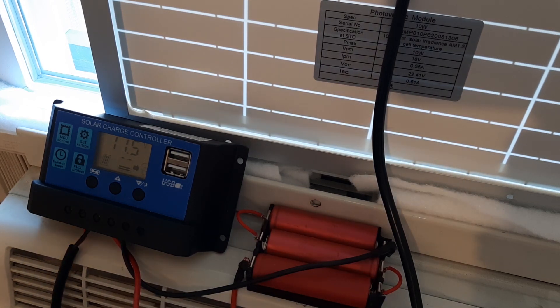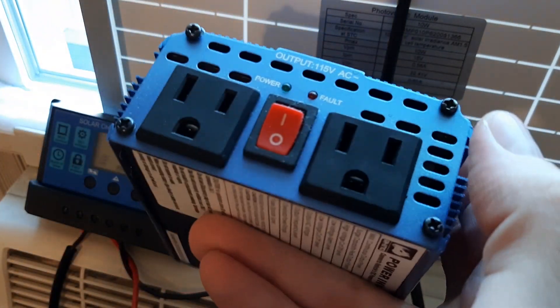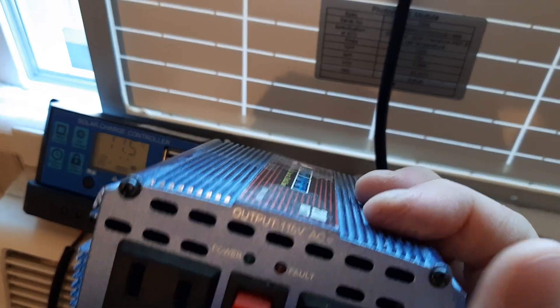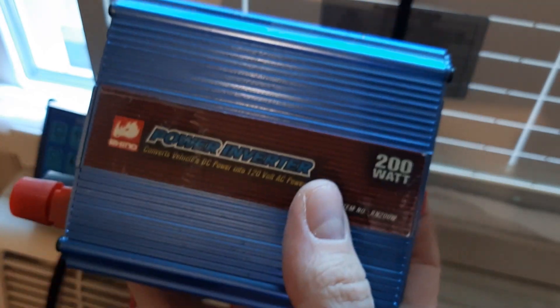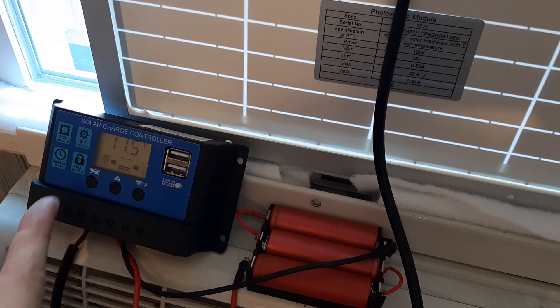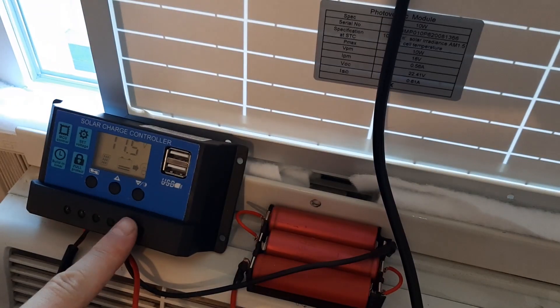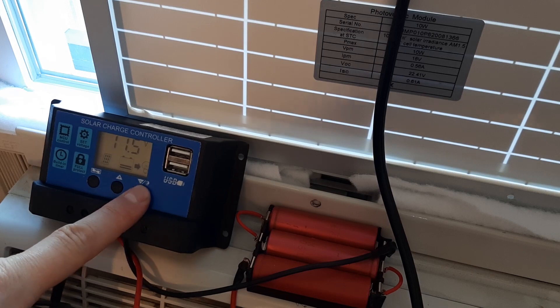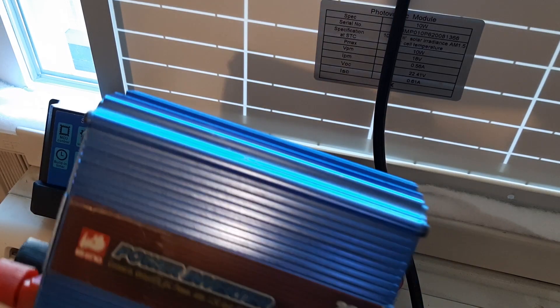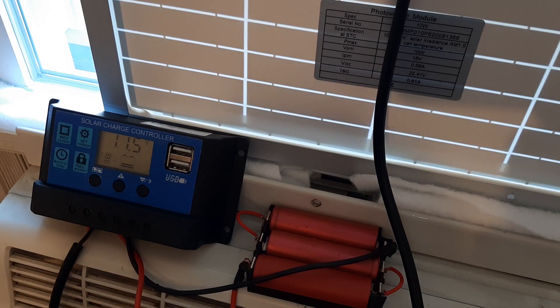If you want to use them as a 12-volt source but don't want to mess with plugging, unplugging, and swapping, here's a little 200-watt power inverter with two AC outlets. Turn it on, turn it off — real simple. It's got the two 12-volt input terminals, and a good one can go up to around 18 volts input. This should deliver pretty clean 12 volts — it'll come from the solar, or the battery pack, or kind of both as a pass-through depending on available light. Take some 14-gauge wire, put it into the outputs, turn on the output, and boom — you've got an emergency outlet that runs on solar, with the battery pack letting it run when the sun's not shining. A 400-watt inverter at Harbor Freight is under $20, probably around $14–15. Wire can be scrapped or bought for a couple bucks. It wouldn't add much to turn this into a true permanent-ish power wall.